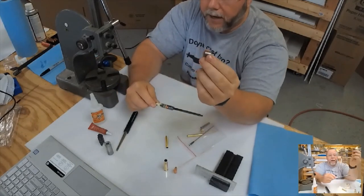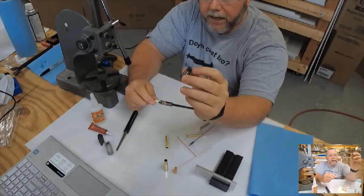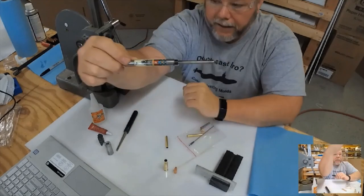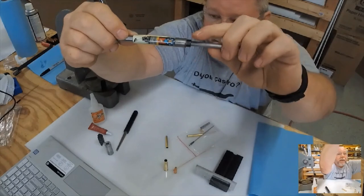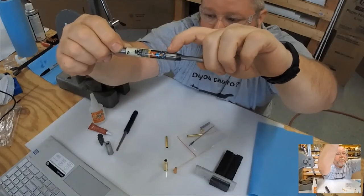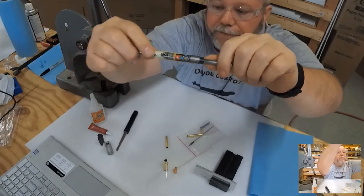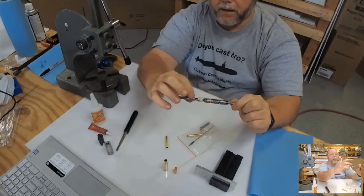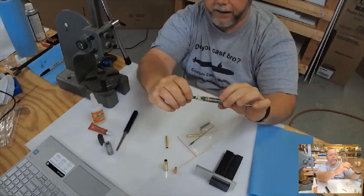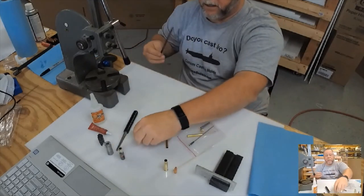If you have a 30-cal bolt-action bushing, you might be thinking how you'll fit a seven-millimeter tube on that three-eighths shoulder — but I'm going to turn it around backwards. I turned it backwards so the shoulder is here but I can still turn to size. So if you have a finial top for a designer or euro and a 30-cal bolt-action for the bottom, it'll work just fine. You don't have to buy the bushing set, but it works great.